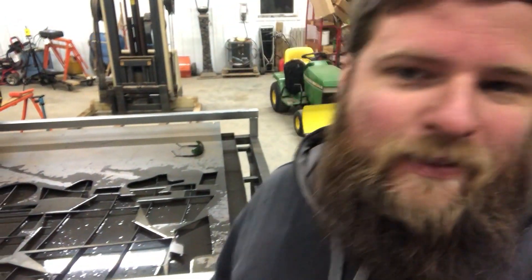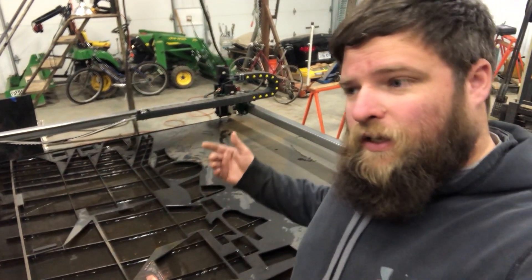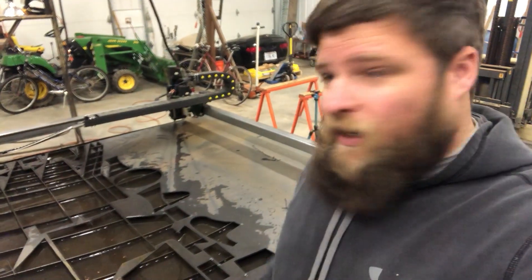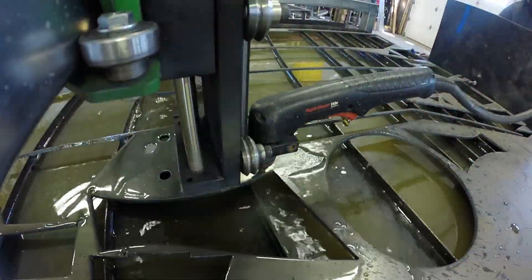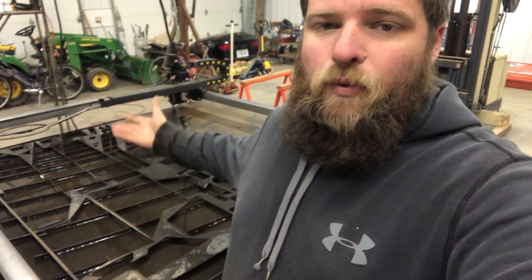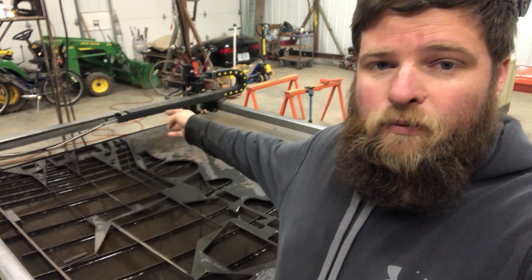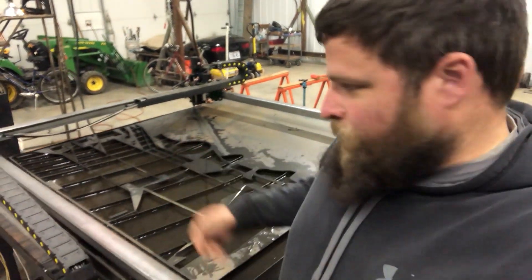What do I have on my forehead? What is that? Oh, it's from my glasses. That's an entire bumper cut out. I had a couple issues. Most likely it's because of me being a tight ass and trying to use as much of the plate as I can. I got a little close on that far end, and some of the flange pieces I was cutting — the plasma cutter actually dropped off the plate on one of the ends, so they didn't actually cut fully. I had one drive error. I'm not really sure what that's about. Most likely that's because I was splashing water right where those flanges were cutting out and they got on the power strip and created a fault. That's what I'm going with.